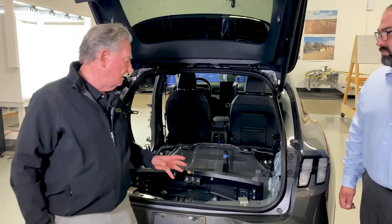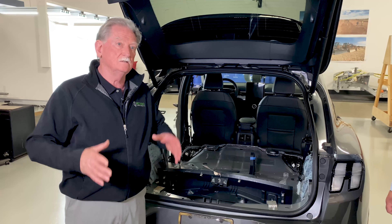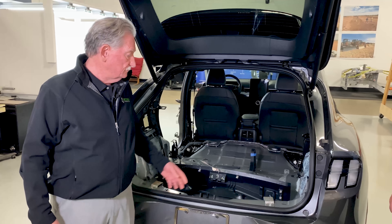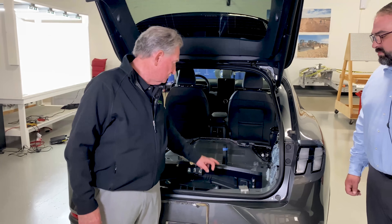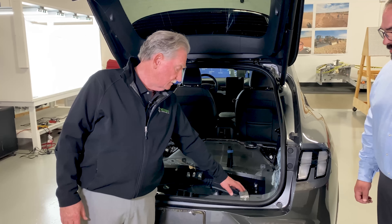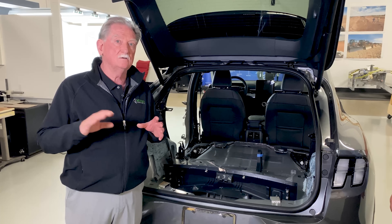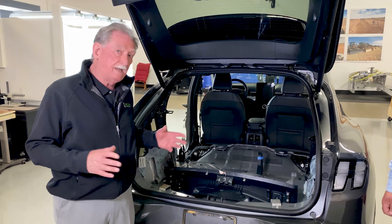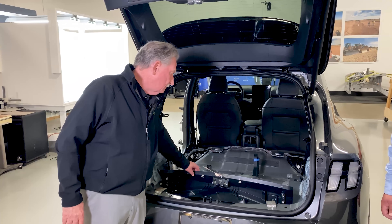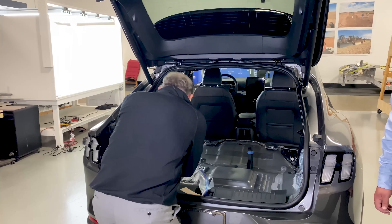This carbuncle right here is something that happens when communication falls off between engineering groups. All engineering is done in silos - that's kind of like the way the bigger companies do it in North America. You wind up with little things like this, because if this person isn't talking to that person and doesn't put a little bump up for that threaded fastener, then something else has to be kludged on. When we were working with General Motors, we actually showed how many brackets were on a car in red, and quite frankly it was hard to find any other color inside the car. Brackets are a communications crutch. This is not so good.